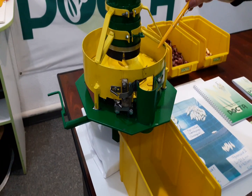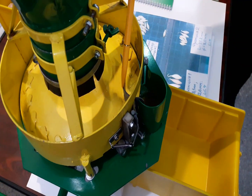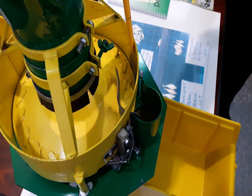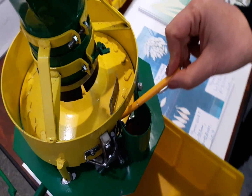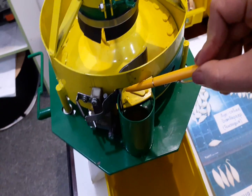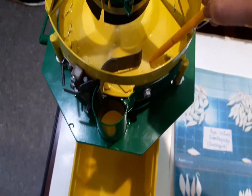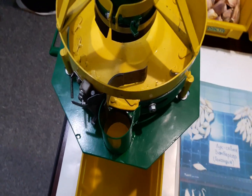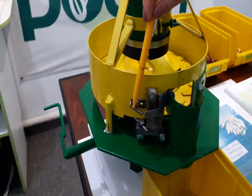The vibratory drive has the following adjustments: first, the adjustment of the clearance between the leveler plate and the outer cylinder; second, the adjustment of the leveler plate height above the distributive cone; third, the adjustment of the vibration force of the leveler.